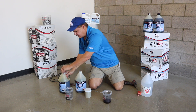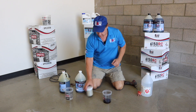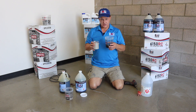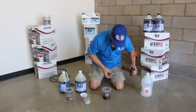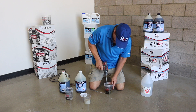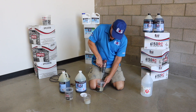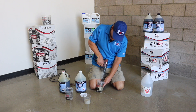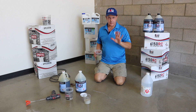I just did two ounces of A and two ounces of B, which means I'm totaling four ounces of mixed material, and I'm going to add about eight ounces of sand to this to get our thickness. You don't always have to do a two-to-one sand ratio but it is preferable — it gets you further along. This product is designed for immediate pour; pot life is basically next to nothing, so only mix up what you can pour in the next two to three minutes, otherwise it kicks off.